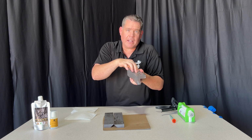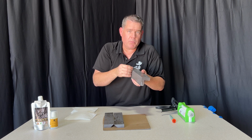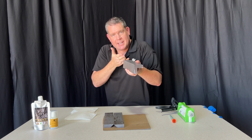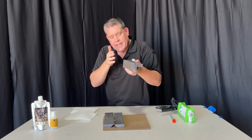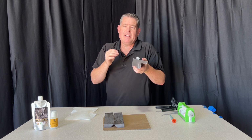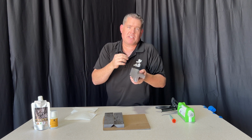And I know it's a 32nd of an inch or 16th. You're like, hey, Sam, no one's going to see that. Trust me, you will see it. We have had fabricators use a dark adhesive to match their top coat. It's a light gray or a white through body. When they polish that down, you see the top coat, you see a band of the light through body, the dark adhesive, another band of through body, and then the top coat on the edge. It makes a sandwich, and could you say that's just the way it is? Sure, but that is not delivering the best product to your customer.